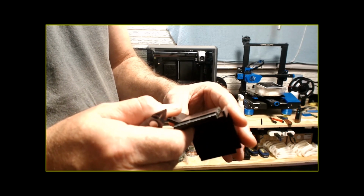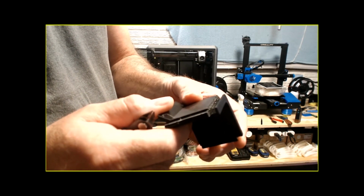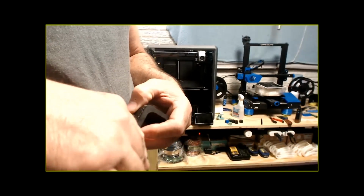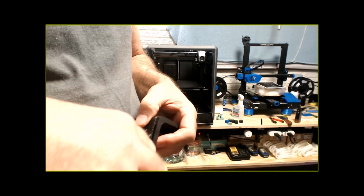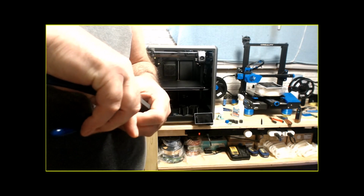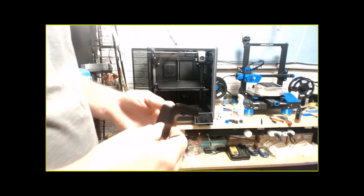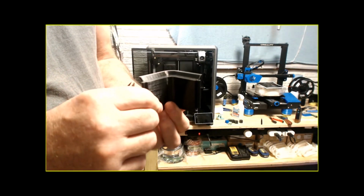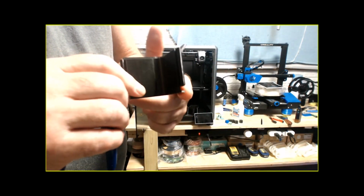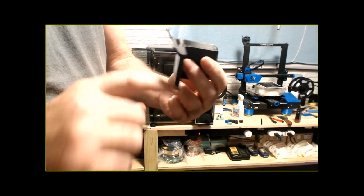And yeah, there you go. You can see it's a little rough. It's not super smooth in there. But that's nothing compared to some other ones. And again, this is default settings. I don't know if I want to adjust those or not. I'm also wondering it might be something to do with the fan. Because it was printing like this, the fan's blowing this way across it. So these cooled faster. These got to stay warmer because they were blocked from the air.